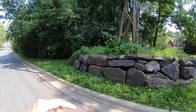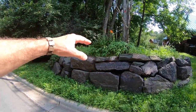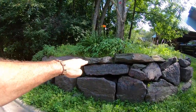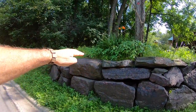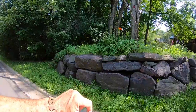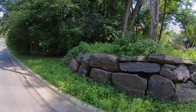One last thing to cover: two-to-three stone transitions and maintaining that same level or line of sight. Here we have two stones stacked up transitioning to a three-stone section, but we still maintain a relatively flat top — no uneven tops. This is how you handle elevation changes inside your wall while keeping it looking clean and professional.